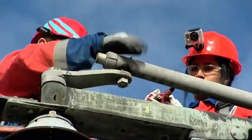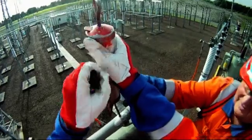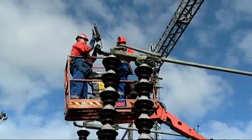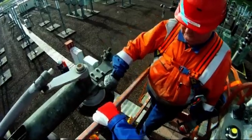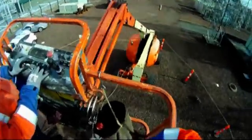Pop that onto the top, push it down and pump the handle. This large switch has three linkages that need greasing. So what's the red stuff doing? The red stuff is grease — it's a lubricant. This insulator turns, and you've now just greased the shaft that goes through connecting this together. So I've greased there, there, and up in the front. Job done.